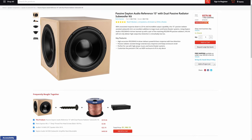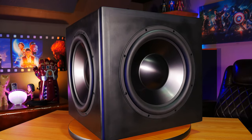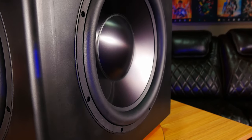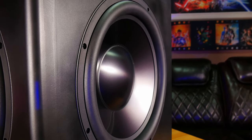What we're looking at here is a DIY subwoofer that we put together ourselves using a kit from Parts Express. They were kind enough to send these parts over to us so we could try it out, and we want to give them a big thanks for that. This kit is actually pretty impressive with a 15-inch Dayton Audio aluminum cone driver paired with two 15-inch passive radiators, all of which go into a custom CNC-cut, three-quarter-inch thick MDF cabinet with a 1.5-inch thick front baffle. Being a parts kit, you'll need to assemble this subwoofer yourself, so let's get into the build.